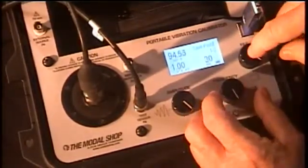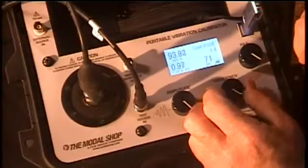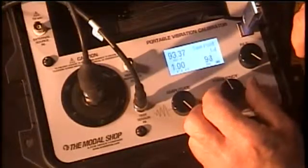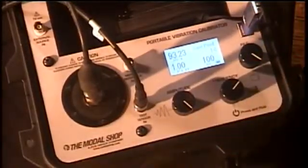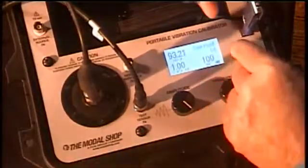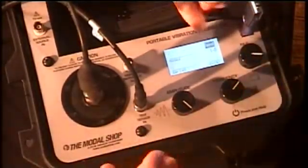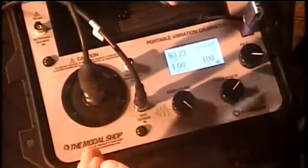I'm going to go to 30 Hz, save a point; 50 Hz, save a point; 100 Hz — which also happens to be the reference frequency for this particular sensor and this particular test. I dial that in, save that point, and so forth all the way up to 10 kHz. Once I'm done I want to save this particular test, so I go down here to record, press that, and the record is now saved — all that data saved. I can optionally put in the model and serial number for the sensor; I'm just going to skip that. And that's all there is to it — this particular test is done. I can now move on to another sensor or another test.